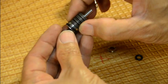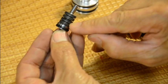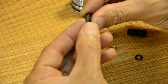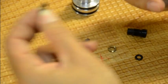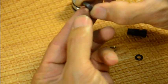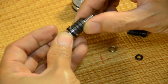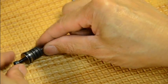For a high power setting you should see four sets of discs — one, two, three, four. I'm removing one set. There are two discs facing that way and one facing this way, and all the sets are like that. Put that to the side.